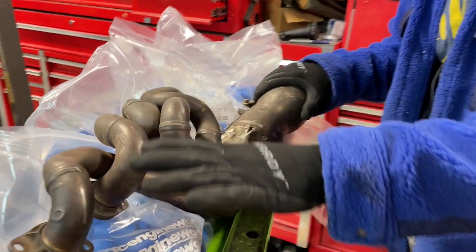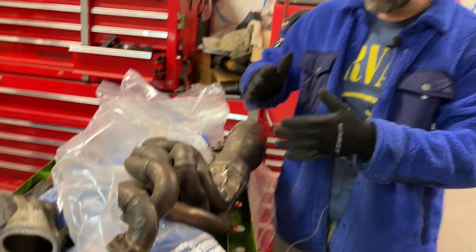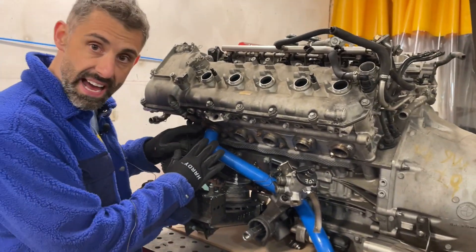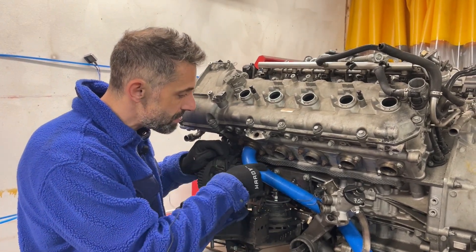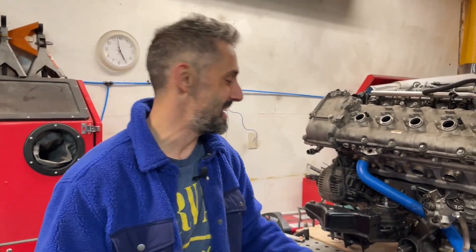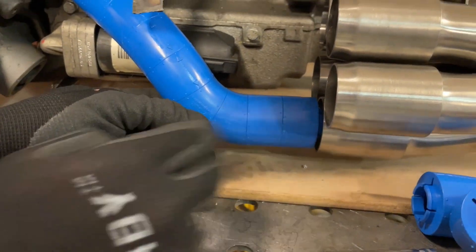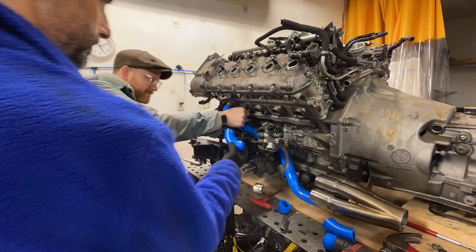All five cylinders are designed — four of them actually going behind the steering rack. I measured from the flange around and down right to the entrance of the collector and it's 24 inches. Each one of these blocks represents one inch, and counting through the route I got 25 blocks — so I'm very close. This is basically going to represent where this tube is going to live in relation to the collector.